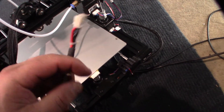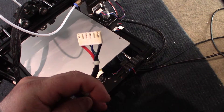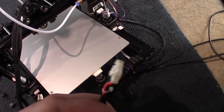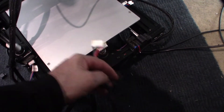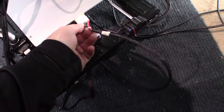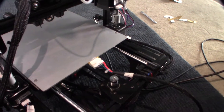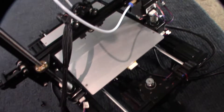So when I was doing a print, I got a thermal protection shutdown, or a thermal runaway, and now this bed is inconsistent — you can see the burn connector. I was printing earlier, and I even had the cable brace on there — it's designed to help protect the connector from hitting that thing — and it still hit it and jacked it up. I don't know what exactly happened, but now I'm not getting a reading.